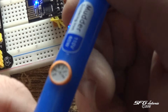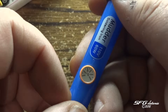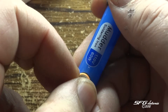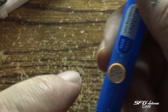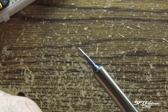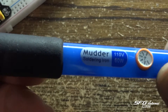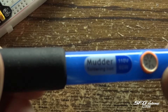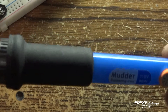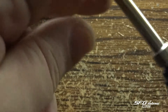As far as the soldering iron — this little dial is real easy to bump. I checked it a couple times — one time it was down at 250, I looked at it a little bit later and it was at 350. Real easy to turn that dial by accident. The tip turned dark blue, but other than that it worked out really good. I give a thumbs up to the Mudder soldering iron. This is the same exact model as marketed under probably five or six different names between eBay and Amazon — identical unit, all roughly the same price.